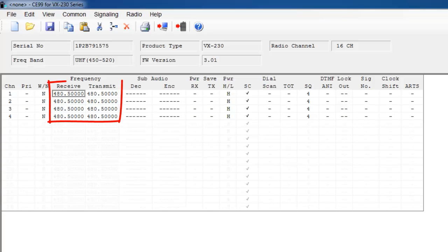To change your frequency, you have a receive and transmit frequency that you can change. If you are not on a repeater, you'll have to make sure that your receive and transmit frequencies are identical. If you are on a repeater, which is a type of signal booster, you'll know your frequencies. For most users, your transmit and receive frequency will be identical. For example, I'm going to change this frequency to 454.55 — I just typed those keys into my keyboard and hit the tab button. By doing that, I only typed the frequency on the receive half and it automatically populated that same frequency into my transmit. For channel 2, I'll type in 454.6 and hit enter, and again the same frequency populated in the transmit.